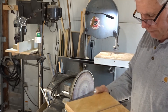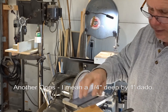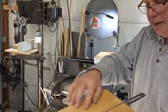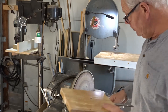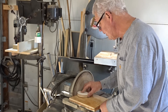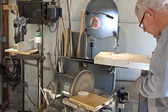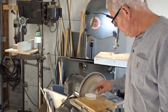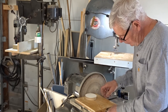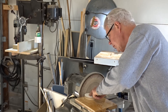I made something very similar - again put a little slot on the bottom for the guide bar to fit in the guide slot, made another little one of these to fit in that rabbet that I put in there. Then I laminated the top piece - it's a quarter inch piece of maple plywood - and I put some poly on it to keep it nice and smooth. So that fits right in here just like that. Now I can go in here and adjust it. You need to be very careful with fingers on this thing because you get them in there too far it'll give you more of a manicure than you need. So you move this up just like on the band saw, bump it right up to the edge, tighten it down, and turn on the sander.